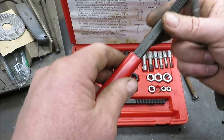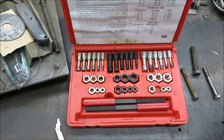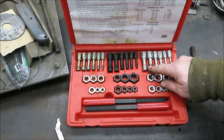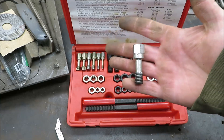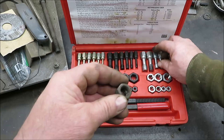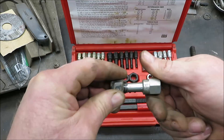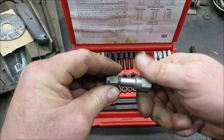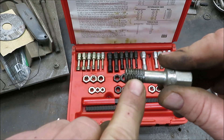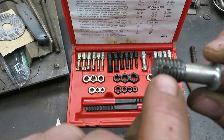It's just a thread file and they work well too. If you're going to re-thread a bolt you need to use the die nuts; if you're going to re-thread a nut you're going to need these pieces here. I may have some bolts I'll end up restoring for the go-kart. You can see how much debris comes out — mainly in these cracks right in there is where you're going to see the dirt. There's not much in there but there is some.